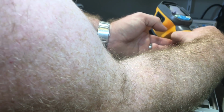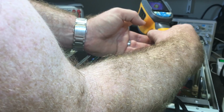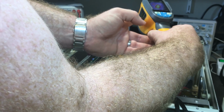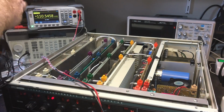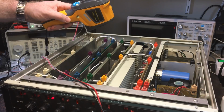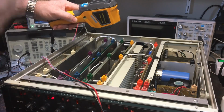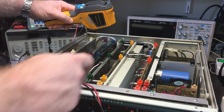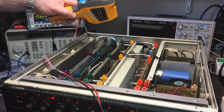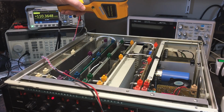The ones further down, yeah, they're warming up a little bit too. So that is 50 degrees, 63 degrees. It's getting 72 as the maximum. Just turn everything on so it's not just sitting there. Again, that could be because of the emissivity, sunlight anyway, because of the infrared reflectance, basically. Something which is metallic, like shiny, like this panel here, for example, you won't be able to get a temperature off it because it's reflecting the stuff around it. Now, what's down there? Something down there is getting warm.